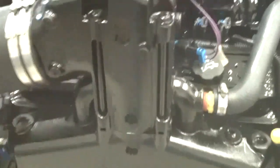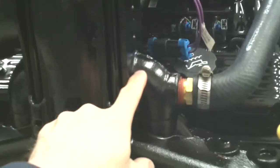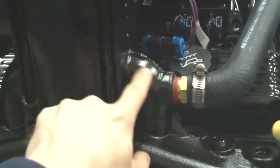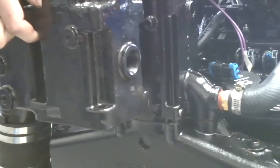On this particular engine here, as you can see, this is a dry joint exhaust system. The easiest way to determine this is you can see this piece right here, and it's on both sides. This is a non-dry joint — you can see it's just flat here on the back. It normally has a plug or a fitting in that location. That's the difference between the two.